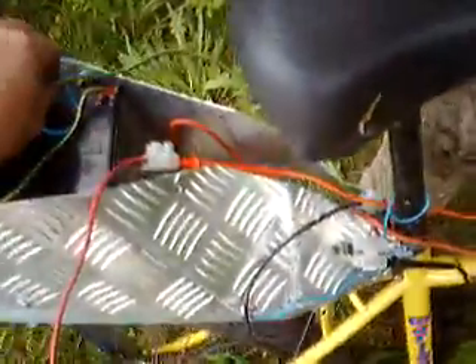We disconnected it from the battery to get just the direct voltage reading. So at walking pace, we've got forty volts direct from the treadmill motor. Once it's connected to the battery, obviously the battery will grab that and stabilise it — like it would with wind generation — and drags it down to twenty-five volts. So that's it guys.